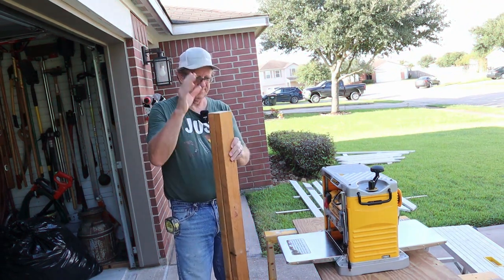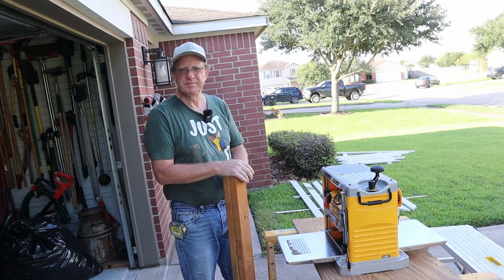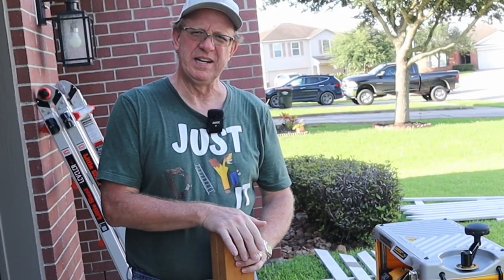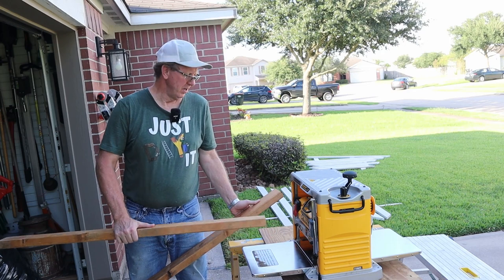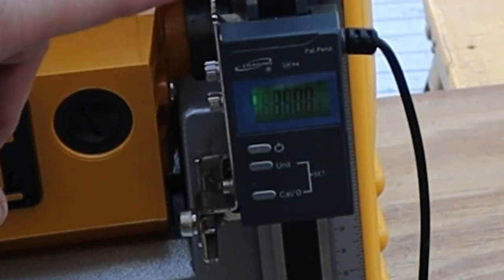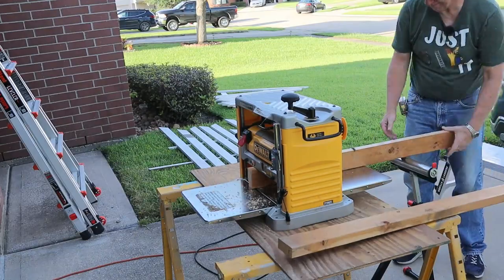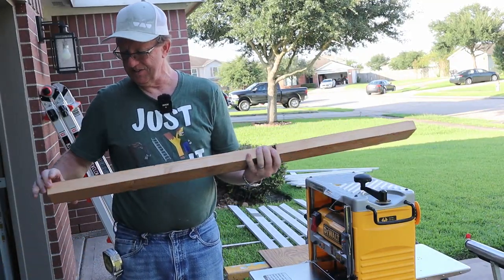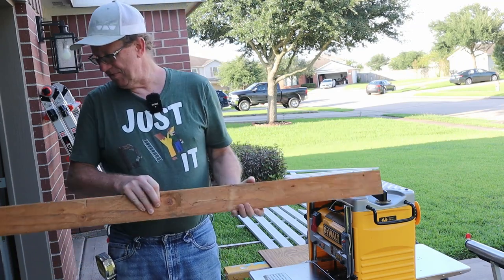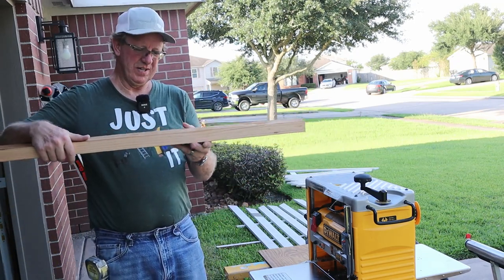The first thing I did was cut two 2x4s at just a hair under four foot — it was an eight foot 2x4 and by the time you cut it in half and square up the ends, it's a little short of four foot, but that's fine. I'm going to plane down all four edges of these 2x4s until I have nice square edges. These are going to be the base or support for the sled I'm making. I got both sides taken down — I took off about 3/16 of an inch in total. Now I'll feed it through this way and take these other edges off.